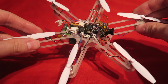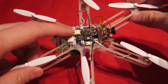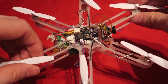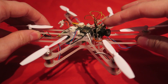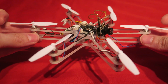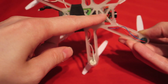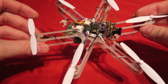The Alien flight boards work via a satellite receiver connected to it. I'm using a DSMX Lemon RX here which offers more frequency hops than the DSM2 protocol. I have attached the little Hyperion camera to the top, which means this will also be my first FPV hex as well. I have connected the camera's power leads to the pins underneath the flight controller, which also powers up the flight controller and powers the camera fine.